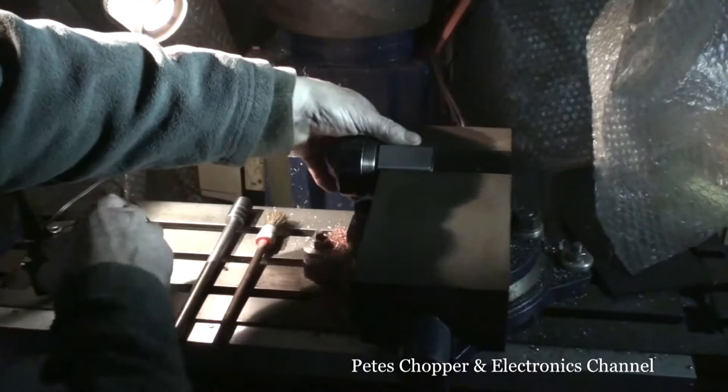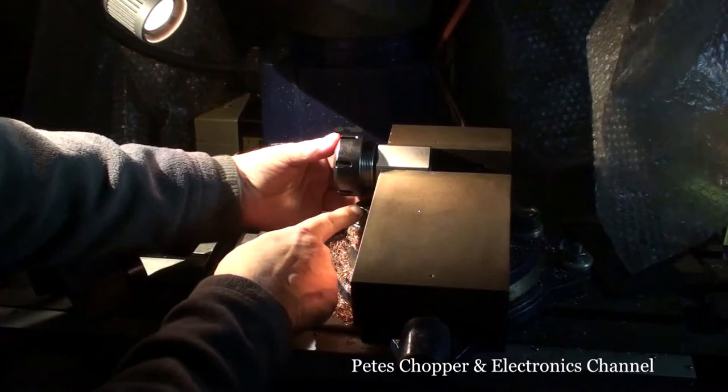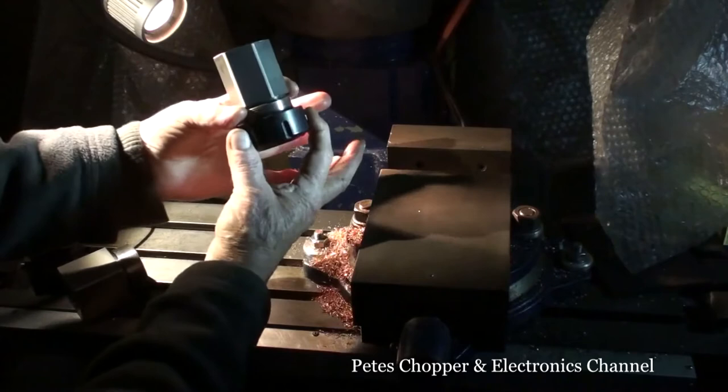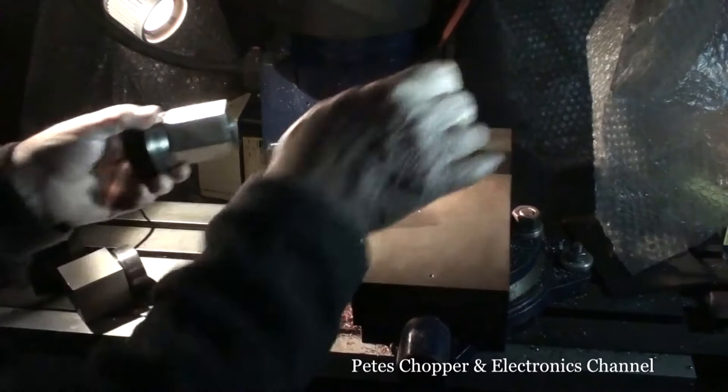One thing is, my particular vise is a rotatable vise, and one of the lock nuts for the rotating table is too high, and it catches the thickness of the holding nut. So all I do is drop a bit of something parallel in to raise the block a bit.